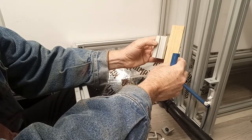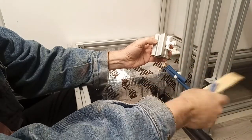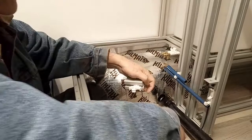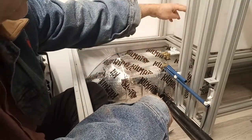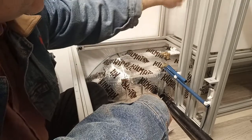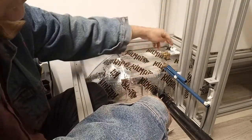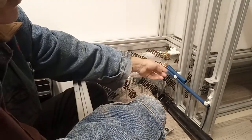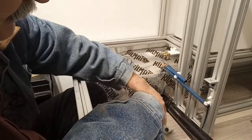We'll look at the panel clip. What I've been working on right now is trying to determine how my plumbing is going to run. There'll be a hot and cold water pipe running underneath the water tank to get to the back for the exterior shower, and a hot and cold water pipe running this way to get to the kitchen sink. We'll also need a hot and cold going across — that's what this lower clip is for.